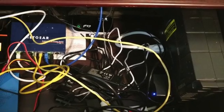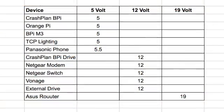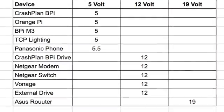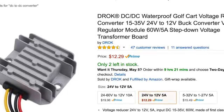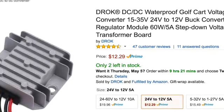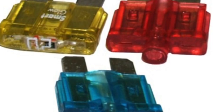The final data center in a cabinet isn't too neat, but I plan on straightening that out soon when I go to DC. I've charted the power requirements for the various devices — some were 5 volts, some were 12, one was 19. So I plan on getting a DC-to-DC converter from 12 volts to 5 volts, making two power buses — one 5-volt and one 12-volt — and a ground bus, then connecting all of the devices to it. The 12 volts is available directly from the battery in the UPS, and I'll tap power and ground off the battery, splitting to straight 12 volts and to the DC-to-DC converter going down to 5 volts.